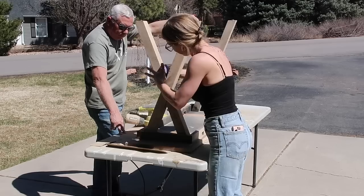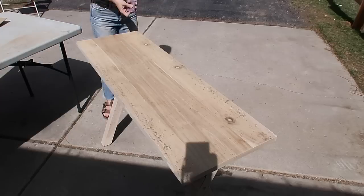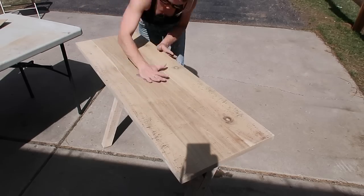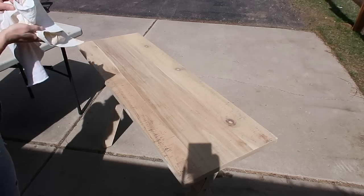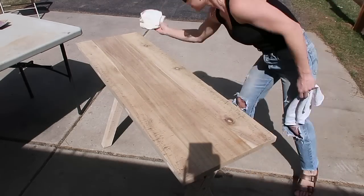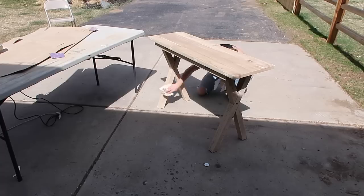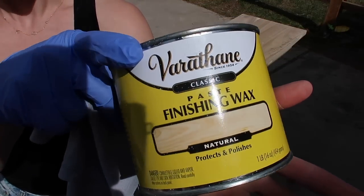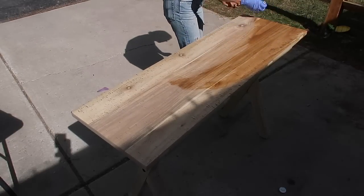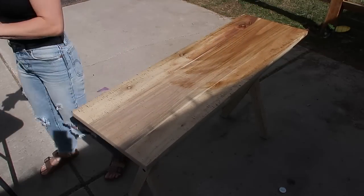This cost like next to nothing. All I did was buy some new legs off of Amazon. After we finished rough sanding it and getting the original finish off, and getting a lot of those grooves and distressing out of it, I took really fine grit - I think 220 sandpaper - and just really smoothed out the top, dusted it off, and then used tack cloth to remove any residual dust. I then went in with my favorite finishing wax in natural. This is just going to help seal and protect the wood. It looks beautiful and does a great job without giving it a shine or an artificial look - just a nice, beautiful, natural piece of wood.